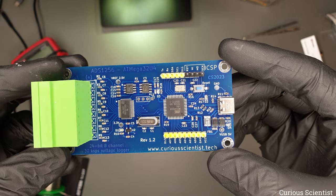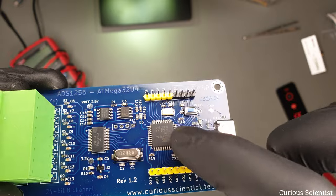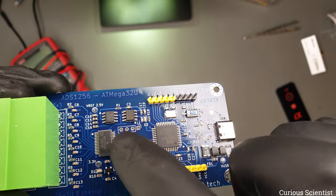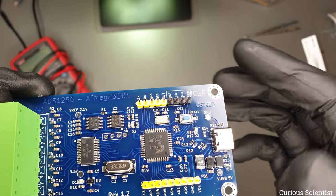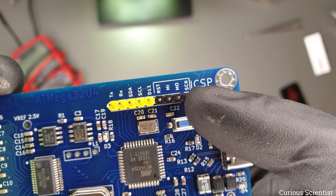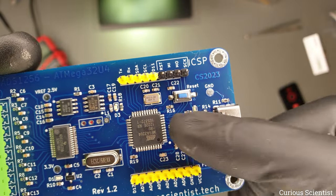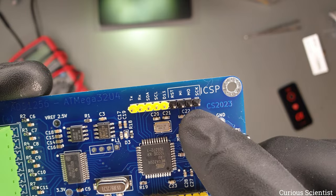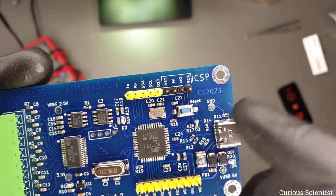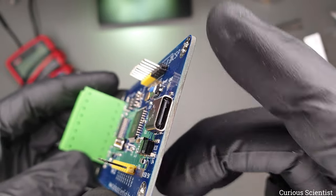The board is ready so we are ready to go to the computer and test it. These are the GPIO pins from the microcontroller — I put all unused microcontroller pins to both sides so if you want to use this circuit with something else, for example a display, you can use those pins. Most importantly here we have the ICSP pins — four pins to use another Arduino to program the microcontroller here for the first time, because if it doesn't come with a bootloader you'll need to use these ICSP pins, which are also the SPI pins.